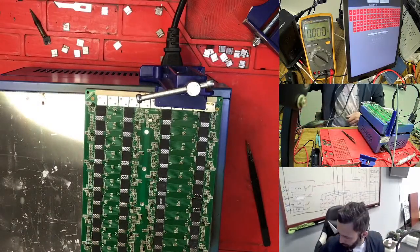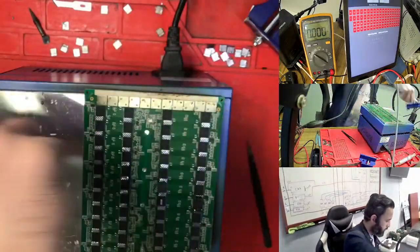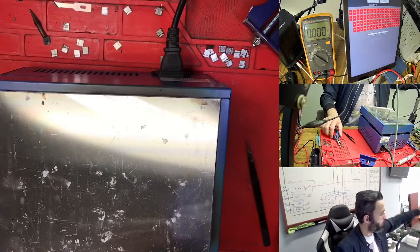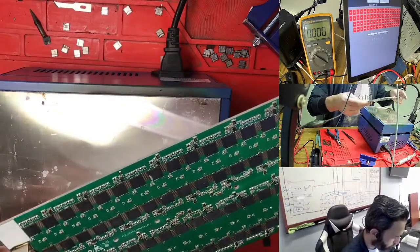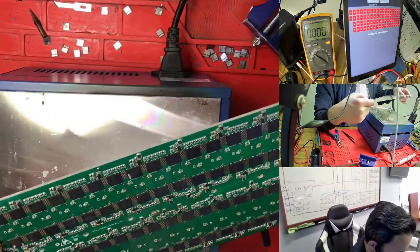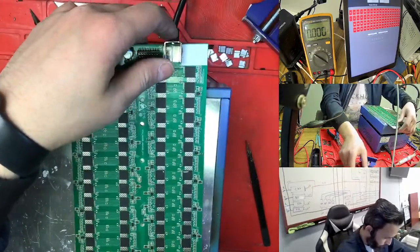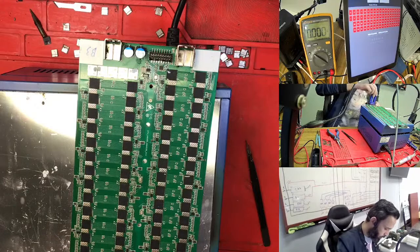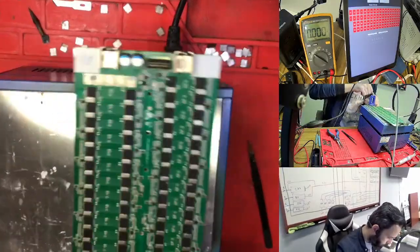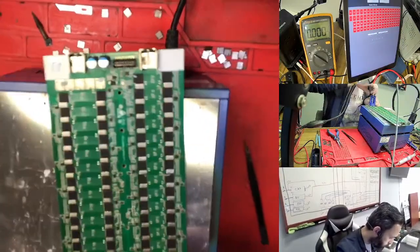So I had this again. We need to take out my clamp and take out this hashboard and put it to the side on the cooling hub. So we try again, but I already changed the chip for this one. Where did I mark it? Okay, here. This one is 36, so we need to change 36. We just need to clamp this one here, because the hashboard is moving. Don't worry, you just need to clamp it very well.